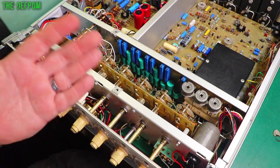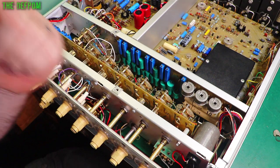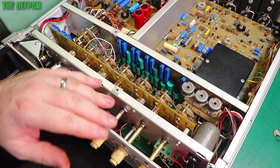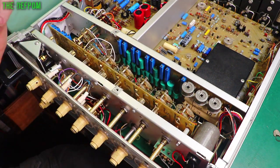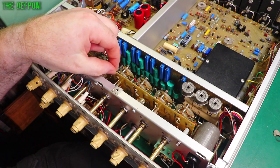I'm doing some repairs on my Fluke 343A again. I actually pulled this thing apart the other day to put dielectric grease on all the switches, because I had issues with the switches being dirty and needed a bit of a revamp. I cleaned it all up last time but didn't put any lubricant on the switches because I didn't have anything suitable. So I pulled it apart, put some dielectric grease on, and then I had a problem with one of these shafts going from the switches onto this board — it broke.